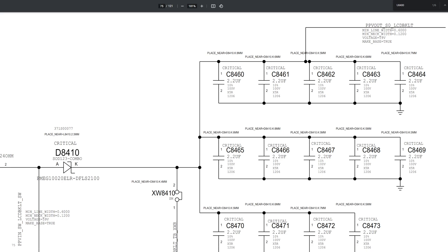To find the short to ground, we're going to do thermal imaging after some voltage injection and see what lights up on the thermal imager. Occasionally you can see visual signs when one of these capacitors is bad, but that's not the case here — they all look pristine, no cracks or solder balls. Typically you'll see a nice big crack through one, but I really don't see that here.